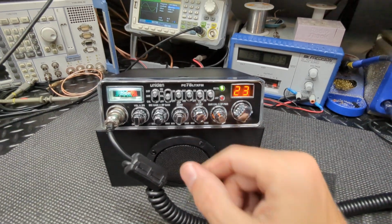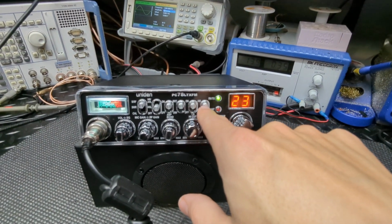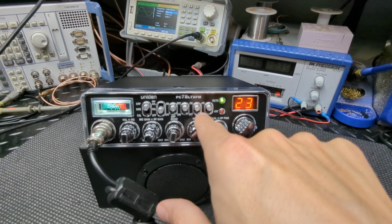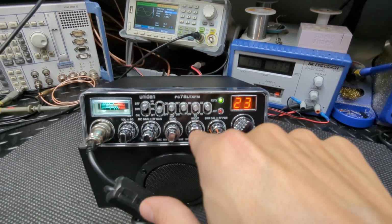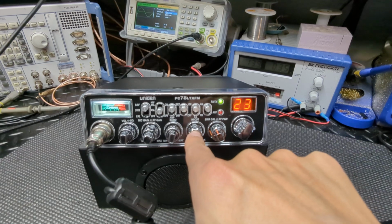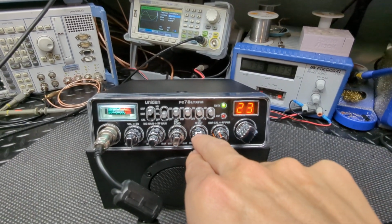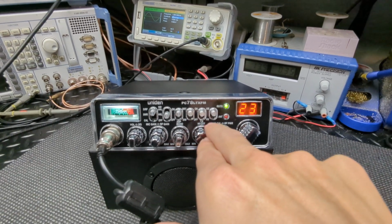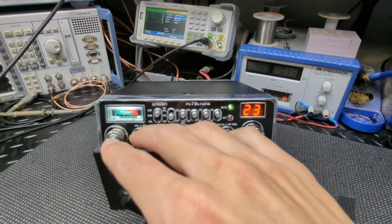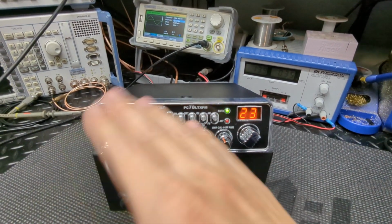So basically, what this one has is FM. That's really the difference of why I did this. I just wanted to do up one of these 78s with FM to see what they were about, and it's pretty cool. It does have a variable high cut filter as well. That's really the only other difference between this and a regular 78 LTX. So the FM and the high cut. Then I went ahead and, you know, I had to put my twist on it.